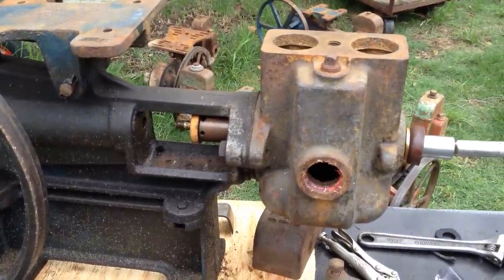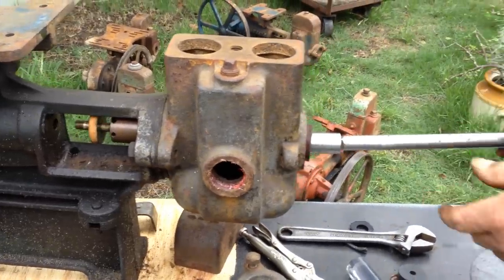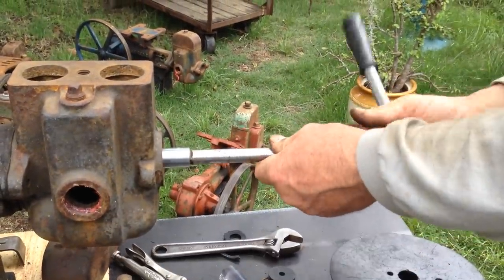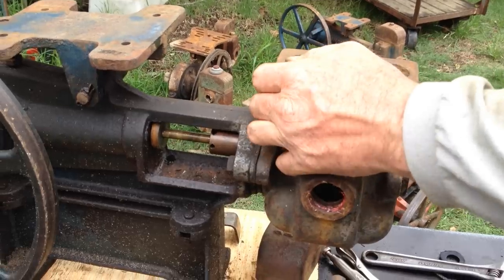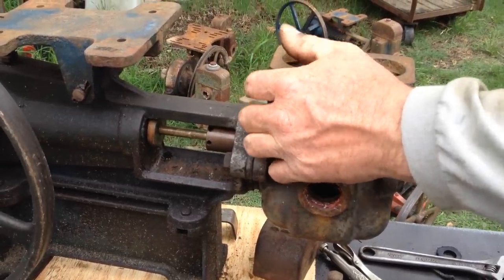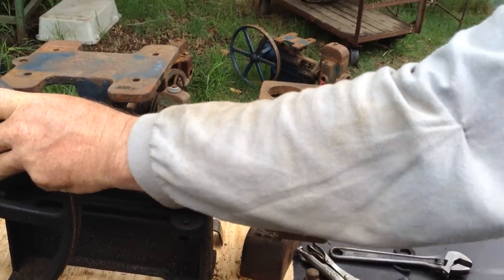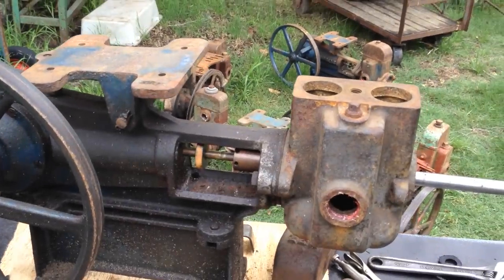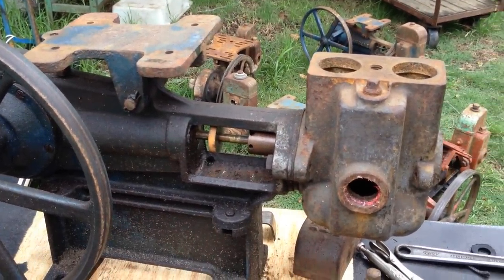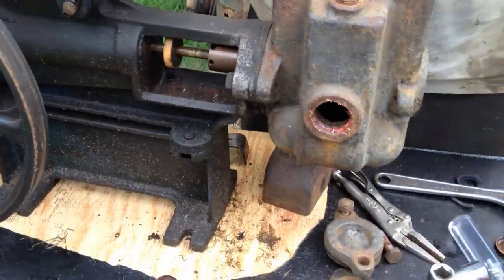The best way to get it going in smoothly is to turn it as it's going in. It's got a flanged area there already, so it should just take that flange, and look at that. She goes in beautifully. Then give it a bit of a push. You can see it's already pushing on the wheel there. And you can see I'm already attached in there. You don't have to over tighten it like a 10-pound gorilla. Just give it a little bit of a nip tight, that's all. Go too hard and you'll strip the thread in there, and then there's all hell to pay.